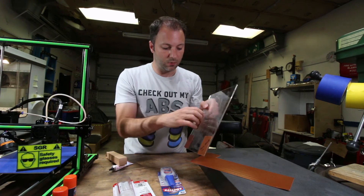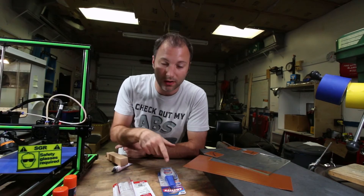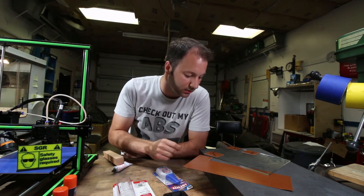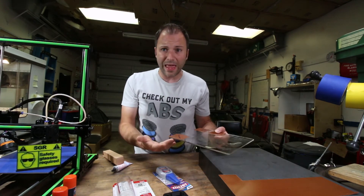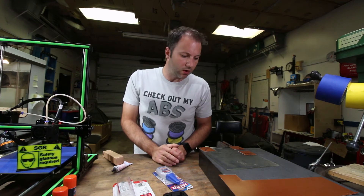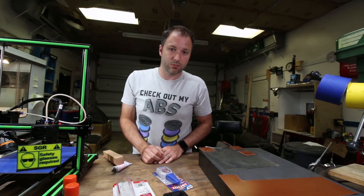I don't know which of these is perfect or if either one is perfect, but I was able to get some pretty nice prints out of this. The nice thing is you don't even have to use a heated bed. You just heat the extruder up and get it ready to go — in fact, I would recommend not heating the bed because I don't think either one of these adhesives is recommended for higher temperatures. If you look at the Markforged 3D printer, which prints exclusively with nylons and uses their carbon fiber nylon brand called Onyx, they print on a Garolite surface laminated to a precisely machined sheet of aluminum, and they have no bed heater. The surface on this is reasonably well textured and the parts stuck very well. You basically give it a quick wipe down with isopropyl alcohol and then a very light coat of purple glue stick, and you're ready to go. No heating in the bed — just wipe off the glue stick, put on a fresh layer, and it works pretty consistently every time.